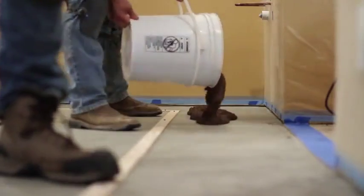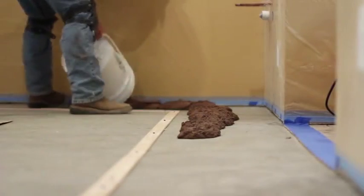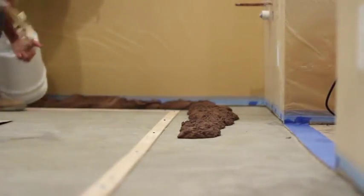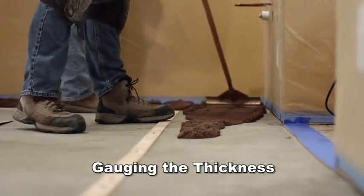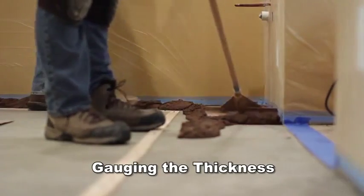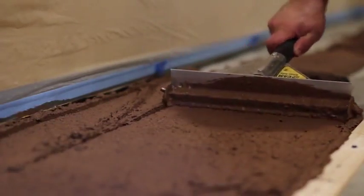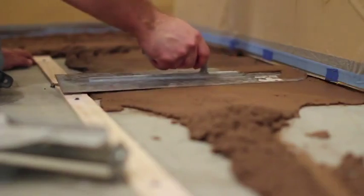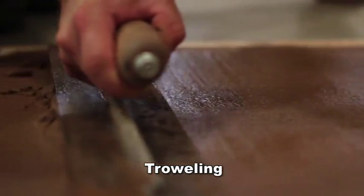If the existing surface has joints, mark their current placement prior to installation. Pour the mixed T1000 Stampable Overlay material onto the concrete surface and use a gauge rake to distribute the product across the floor at a specific and consistent depth. The gauge rake should be set to the maximum depth of the grout line of the stamp. If textured skins are used, then a 1/4 inch depth should be adequate to achieve the desired imprint for most textured skins. Once gauged to the proper thickness, use a pool trowel or Fresno trowel to finish the material.